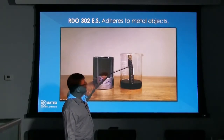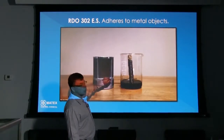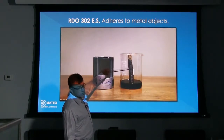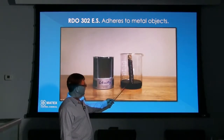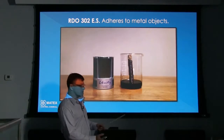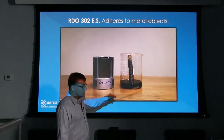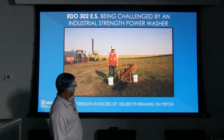What this oil will do to this rust eventually is peel all that rust off, especially if there's any water going by it — such as if you're injecting it down into your hammer and the rust was on the inside of your hammer. It would eventually peel all that rust off. So also if you had a hammer or an old tricone that was seized up, throw that oil in there over the weekend and there's a pretty good chance it will get in there, pick that rust away, loosen it up and maybe get your hammer or old tricone back working again.